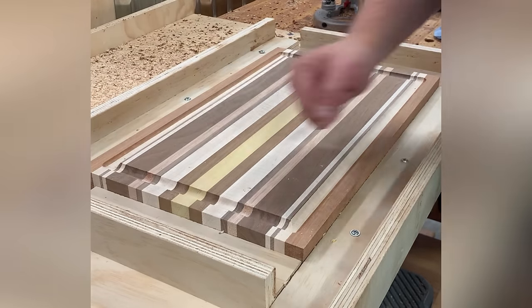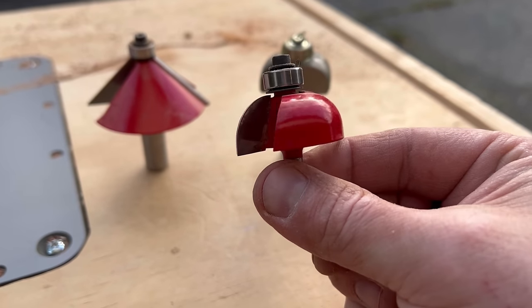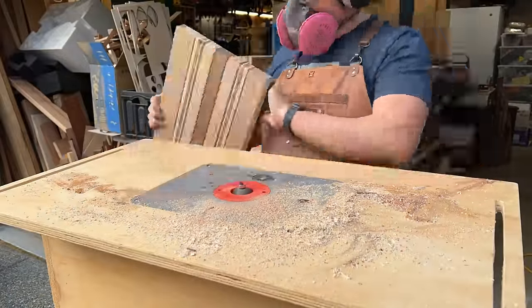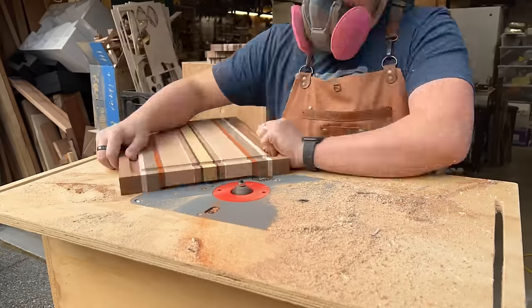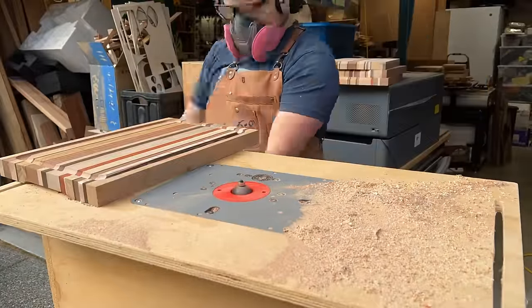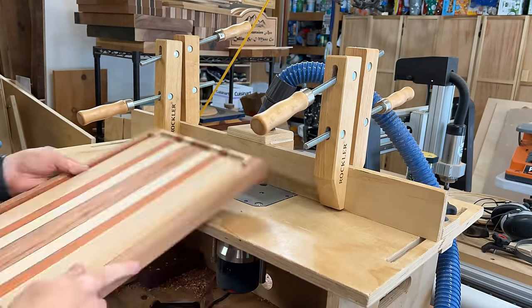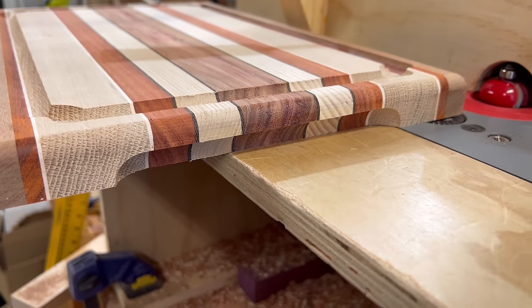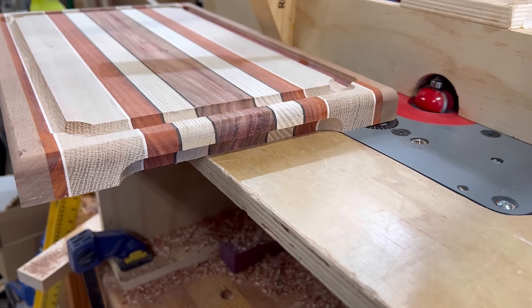You can certainly go without a juice groove, but customers, family, and I all love them — especially for barbecue boards. For handles, here's a cove bit — quarter-inch shank — or a bigger cove bit, or a chamfer bit. At the router table I'm doing some hand holds, free-handing incrementally. Don't take too big a bite right away or it'll grab the wood. An easier way is to use the router table with a fence and stop blocks to control how far you go. Keep moving — don't go slow or you'll get burn marks.